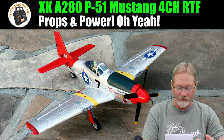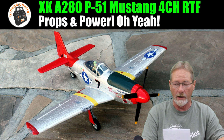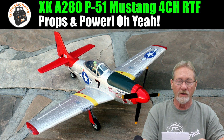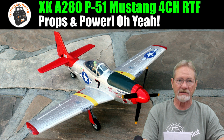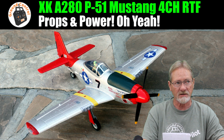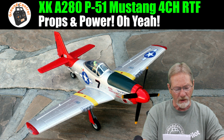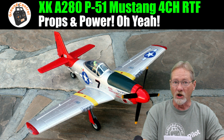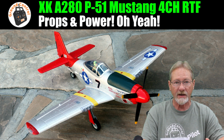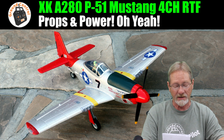So the only one I have a question about is that 8x38 prop pulling 9.1 amps at full throttle. I don't know what the max amp capacity is of the stock ESC. It is not marked. I sent XK an email asking for this information a couple of days ago. So far, I have not heard back from them yet. So we'll see if they actually respond, because that was their customer support email address that I sent the question to.